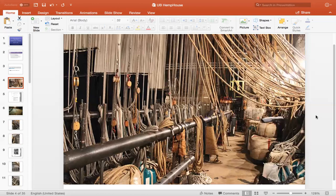Hey, Eddie. Yeah. Do you have a sense for the average number of crew, fly people, on a particular show? Well, on load-ins, a lot of this depended on the size of the pieces we were flying. If you had a really heavy piece, for example, our electric pipes, when we were flying electrics, you would have your head flyman, an assistant flyman, and three or four other people to assist in the tailing of the block and falls when we were doing the lifting. We'll talk about how we utilize them. But the fly crew could be anywhere from two people to six people for a load in. For a show, it just depended on how many pieces you needed to move at the same time. Right.